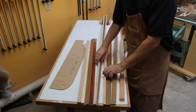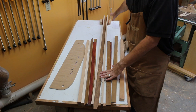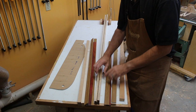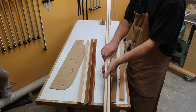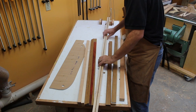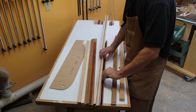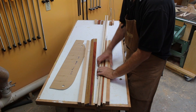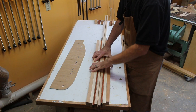With all the pieces cut to an inch and a quarter, now I get to have fun arranging them in different combinations — kind of like making a cutting board — and it's the creative part of the process that I really love. I have a strip of teak running right down the middle of the handle; I've never done one all the way down the middle before. I didn't have enough thick maple, so it's teak down the middle with maple on either side. The shaft is 64 to 65 inches long for me, then teak, padauk, teak to get the red between the dark, then maple to lighten it up, and finally some cherry on the outside for another bit of reddish color, mirrored on either side.